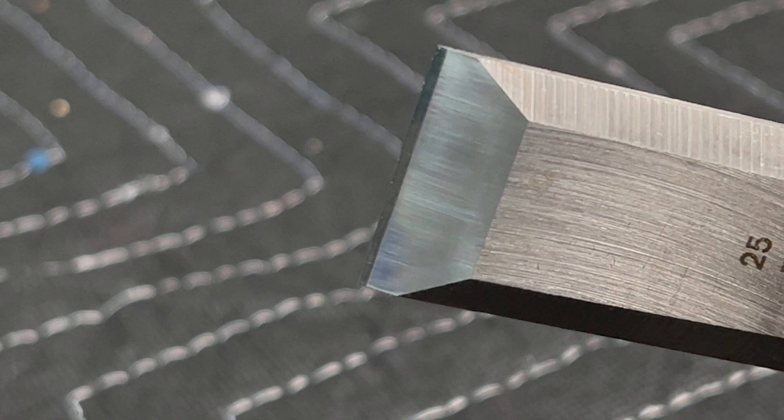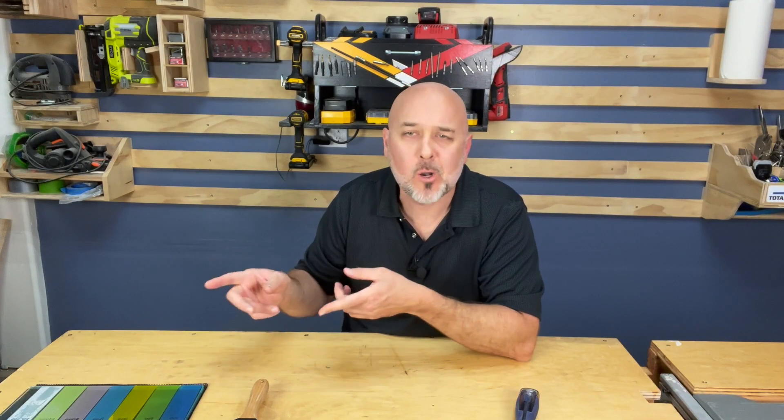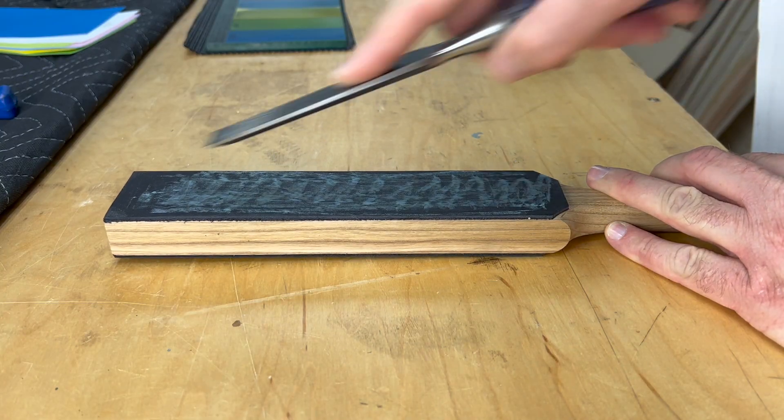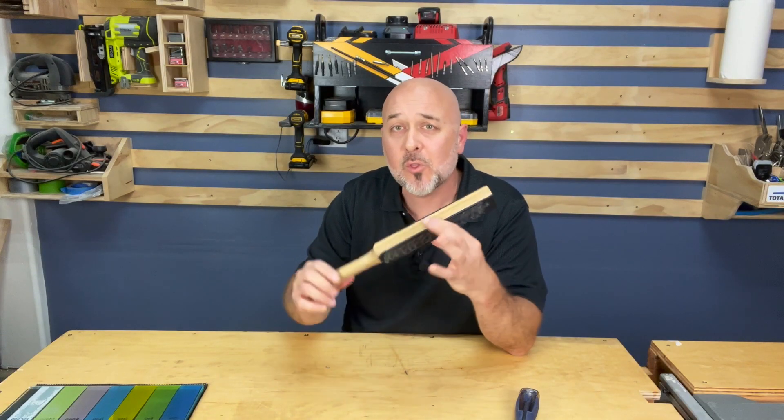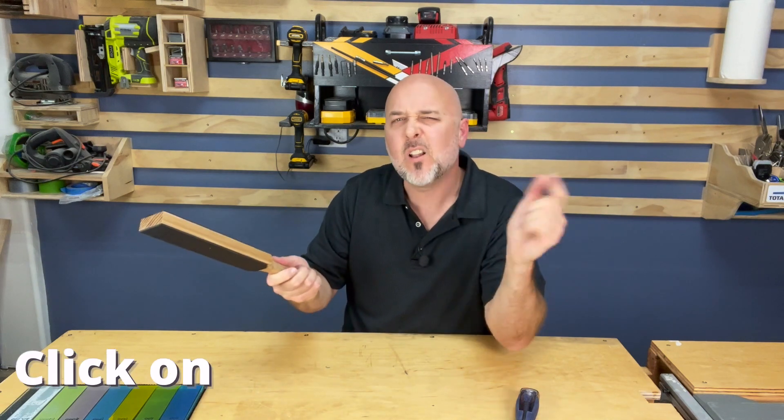Don't number 13: Don't start chiseling an inlay, a dovetail, or any other workpiece without a strop on hand. The strop maintains the sharp edge on the bevel of your chisel. While chiseling you'll eventually want to go back to your float glass, grit papers, or whetstone, but the strop prolongs the life of those tools. This particular one is a double-sided leather strop with a hardwood piece — I'll leave a link in the description for this one from Beaver Craft.